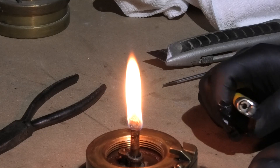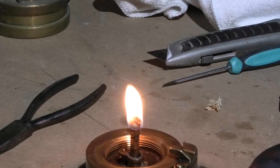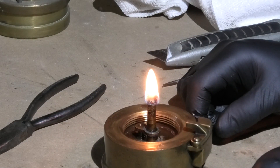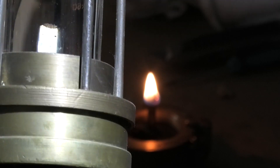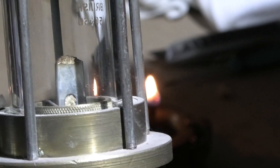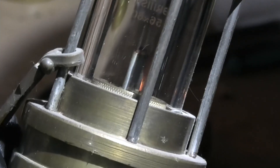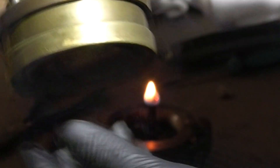The new wick has already been soaking so it's already soaked in paraffin. I'm going to burn off all of the loose bits of the wick just to make sure the height is right — I'll leave that burn for a second. Just while that's burning, I'll show you this other lamp which is very similar — an old GPO type lamp. In here, instead of having the winder, you can see the way the wick is adjusted: there's a little scraper that you just move up and down to drag the wick up in the burner, which is a very basic idea. Of course this is a much more basic lamp — it hasn't got the igniter or anything like that, but it does have a gauze inside. It's much cheaper basically.